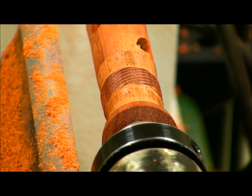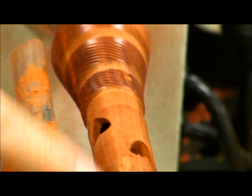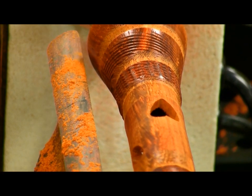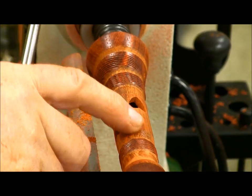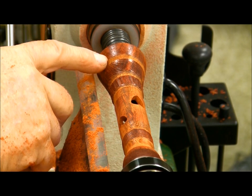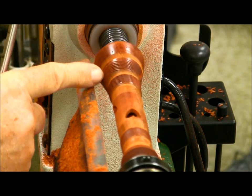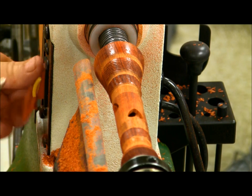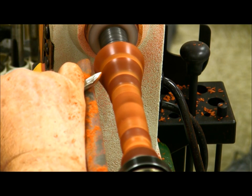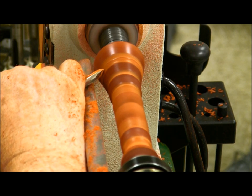Is that what's called a fingernail grind? Not really. Now since I cut that away you can see how these patterns stand out much better than if I had just left it. I'm going to go back with a skew and take a little more off. The nice thing about the lathe is you can make instant design changes — sometimes by choice, sometimes not.